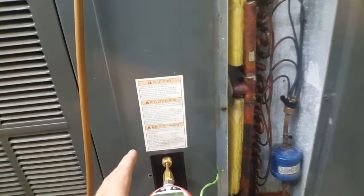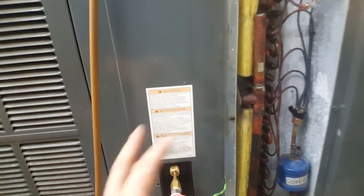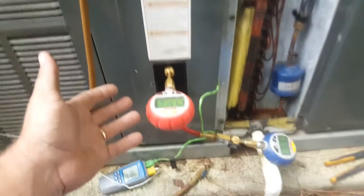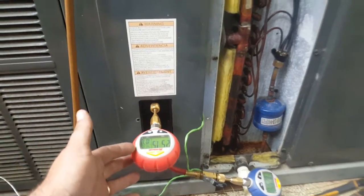After I put in about a pound of refrigerant, I put some refrigerant in that low pressure port — just about eight ounces — just to push that oil all the way into the system, so it won't be clogged up in that port and cause a mess. Now that I've finished that, our system holds just over six pounds — we are at about six pounds.